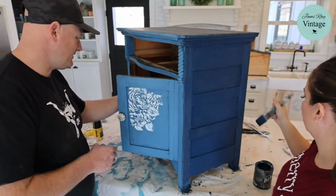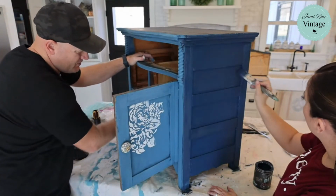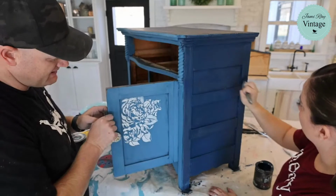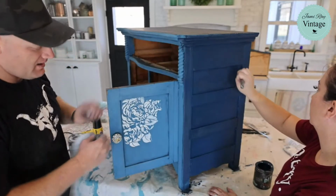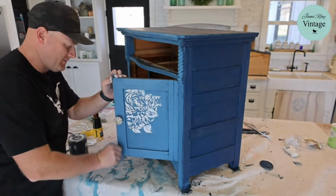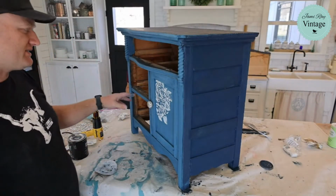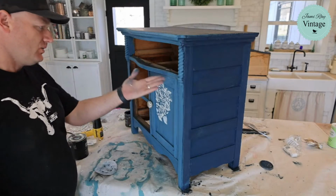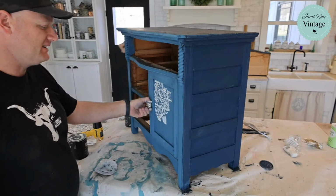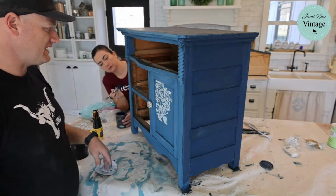I'm going to have to sand this edge here. So sometimes when you get old pieces like this, if you painted it and you've got paint on it, I would sand it then. Make sure that there's no excess paint on the inside lips here. But if it's settled or it's not sliding good, you don't necessarily have to do a bunch of sanding. Sometimes if you just wax that or use hemp oil, which we like to use, it'll help it slide good. It works as a really good lubricant, and then you don't have to do a ton of sanding.